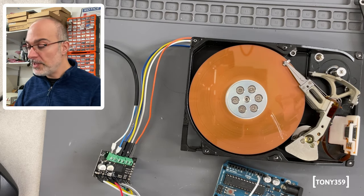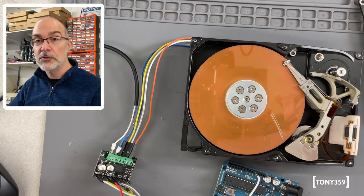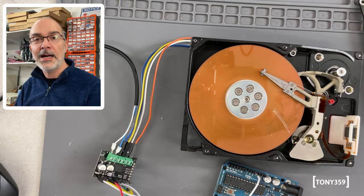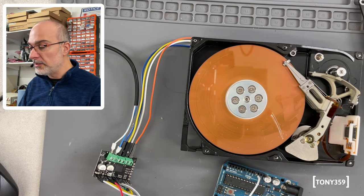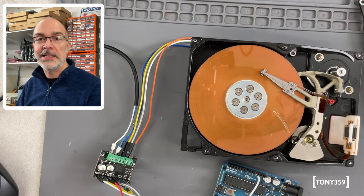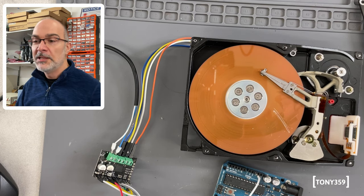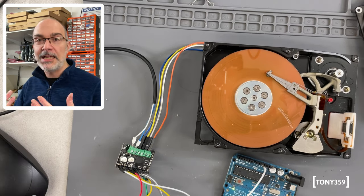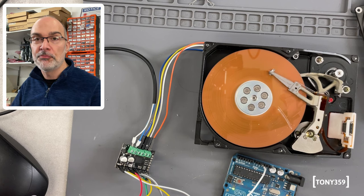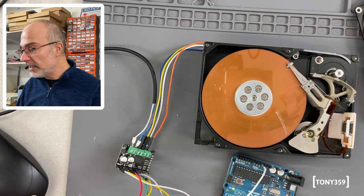Now, the next step would be to plug this into the IBM and have the stepper motor being controlled by, I think, the activity LED of the XT-IDE. Now, that won't give perfection. Obviously, the activity LED of the XT-IDE is not the head movement, so I'll have to come up with some sort of random movement, and hopefully it will sound real enough, especially for someone who doesn't know the computer and doesn't realize what's going on. But we'll give that a go.